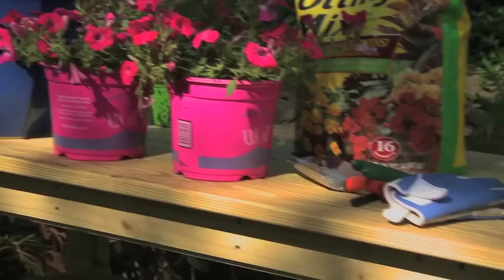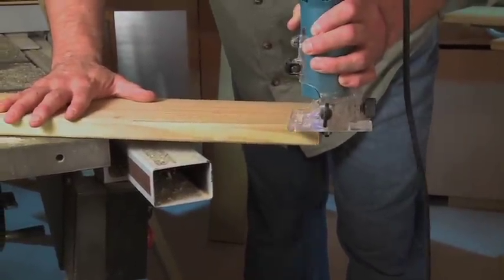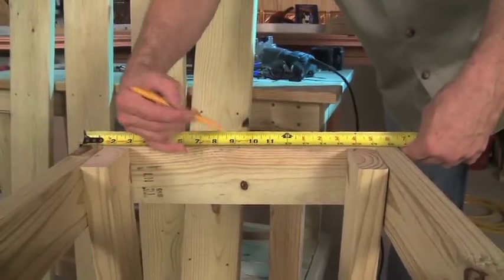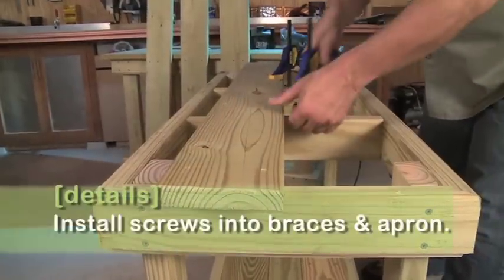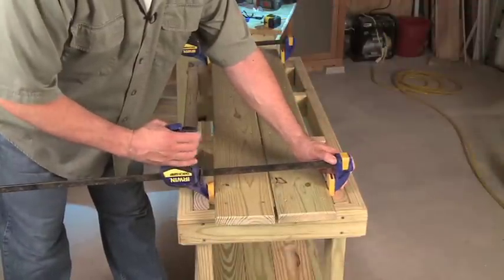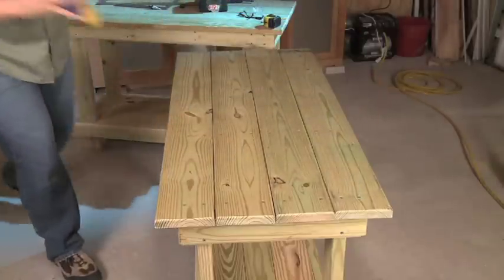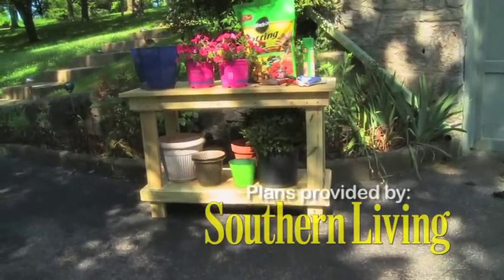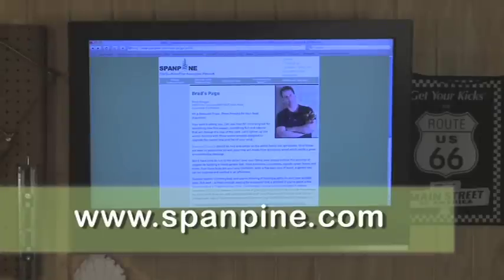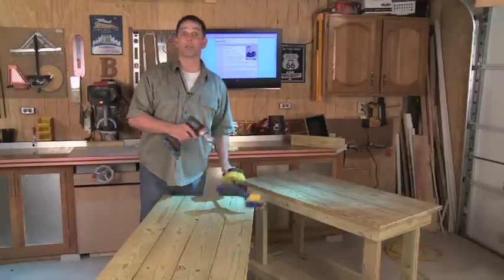Finally, the top is made up of four pieces of the five quarter inch deck material, each measuring 48 inches long. Once you've cut them, use the round over bit to soften the top and bottom of each end. Then measure and mark the center point of the table along the length. Install the first board to align with the marks, then clamp and screw the remaining boards into place. All that's left is the cleanup — not bad for an afternoon's work. Don't forget to check out my page at the Southern Pine website for tips and great projects every month.